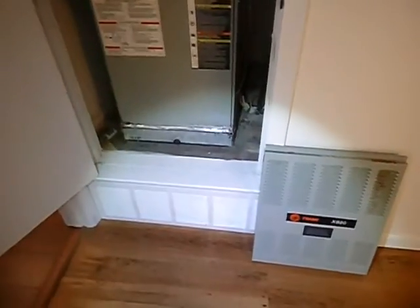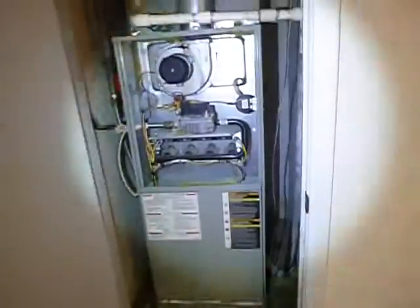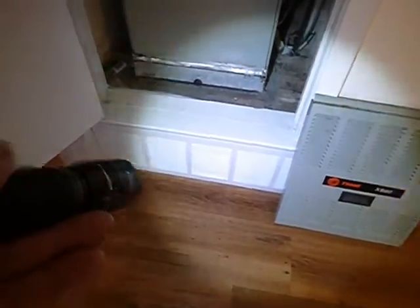There's too much orange — I'd have an HVAC technician look at that. That's a clue. Now this is the air return for your furnace. It heats the air through a heat exchanger and broadcasts it out through the vents. This air return is not supposed to be closer than 10 feet to the furnace, because it could spill carbon monoxide — from that concerning flame — into this grill and broadcast it all over the house.